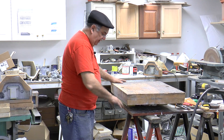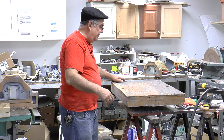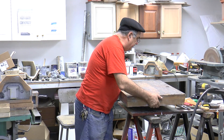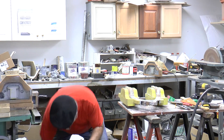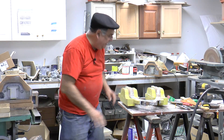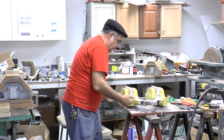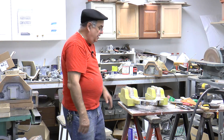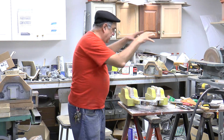They just picked this up with a couple of guys — put handles on this, pick it up like that, put it on the side. And now you're going to see sand all around in here, all around, and you just see the top half of the pattern. They put the other half of the flask on there and they mold this side.